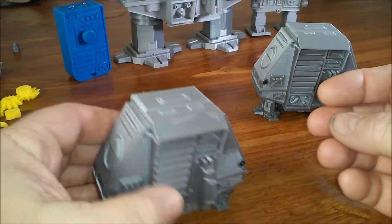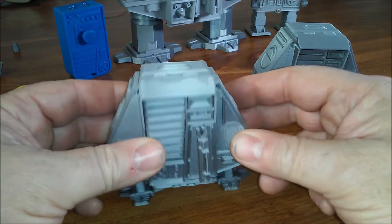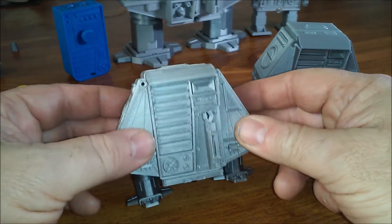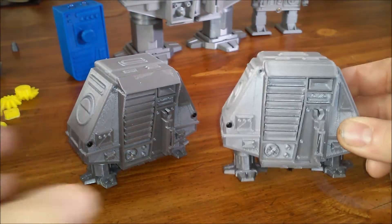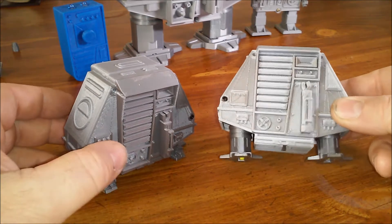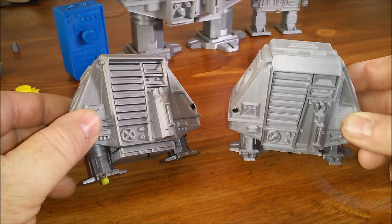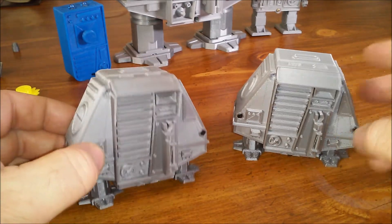As you can see, they're running at two radically different speeds. This faster one has a 100 RPM motor and the slower one has a 30 RPM motor. The motor is an N20 gearbox motor. The power is provided by two CR2032 coin cells that are inside.